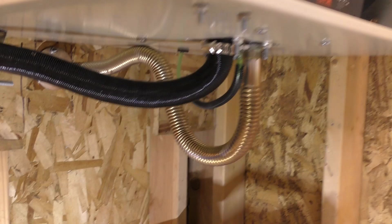The most common critical comment was that my exhaust was shaped like a P-trap, which could trap water in it. The reason for that is two-fold: the exhaust tube has smooth swaged ends that you have to use to connect to your fittings. If you cut into the corrugated part of the pipe, there's no way to properly clamp it onto your ends. So I had to put that excess pipe somewhere and just bent it downward.